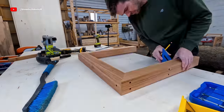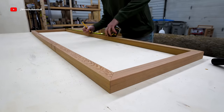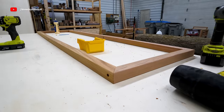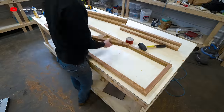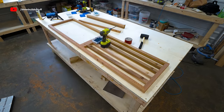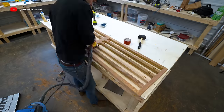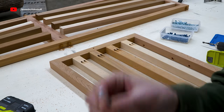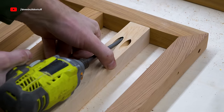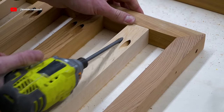Now for the bench I'm building the last two legs the same way. The bench is built pretty much the same as the chairs with some key differences. For the backrest I framed out a longer rectangular shape with a ripped piece of two-by-four cutting right down the middle, then installed more two-by-two spindles with pocket hole screws. One note: when I showed how to build the chair I had zinc-plated screws, but the zinc isn't rated for outdoor use — I've swapped those all out for blue coat screws. Just build with the blue ones and save yourself the work.